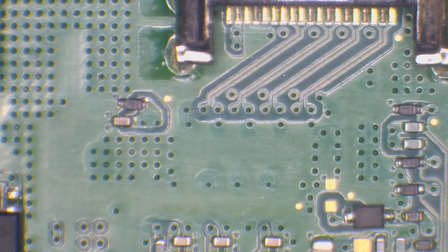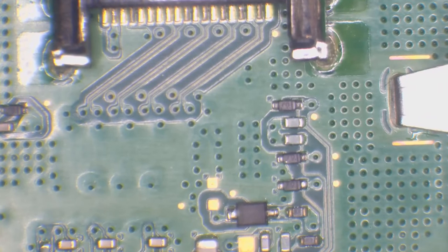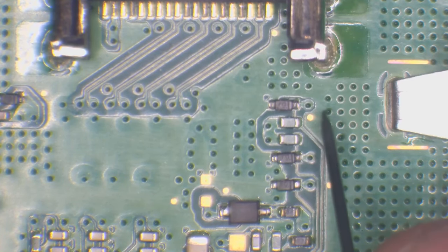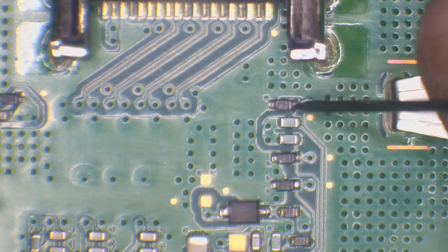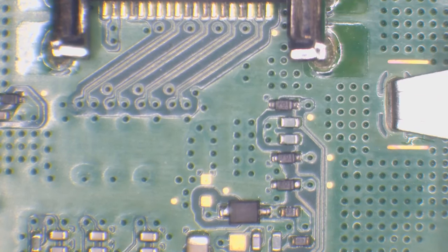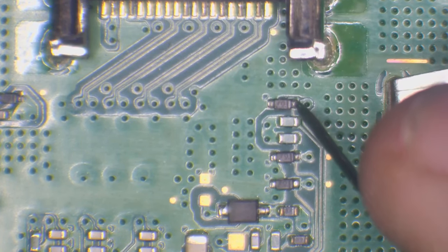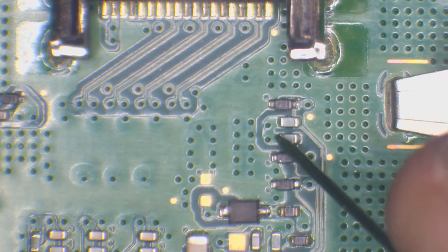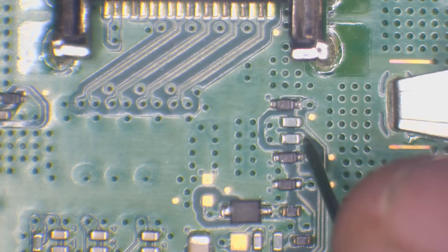Next thing I check, in diode mode, so I pop the red probe on ground and I check pin number 15. Pin number 15 is this top diode here. So red probe on ground, black probe on here. Whoops, that's not in diode mode, it's in continuity. So, diode mode there, check that. And we get 0.5 volts, which is normal. Check these here. And we get, sorry, it's this side.